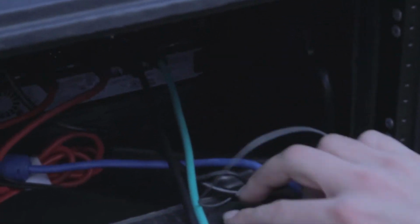So it's always good to check your signal flow, outputs to inputs, source to destination, typical troubleshooting stuff. So this is an 1/8" stereo cable to XLR male. And so it's in channel 3 and 4 of the line mixer. Once that's all plugged in, go ahead and test it out.